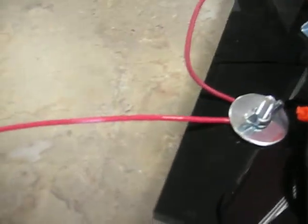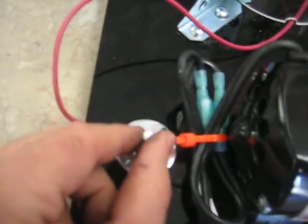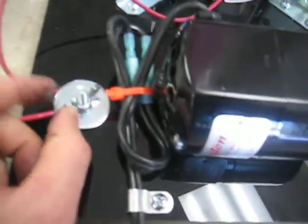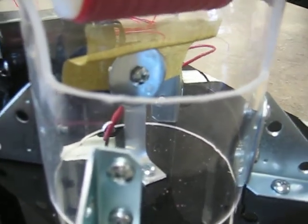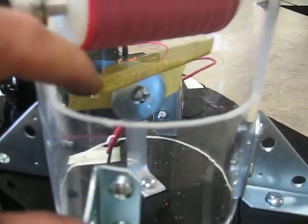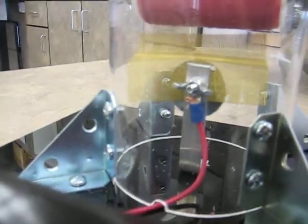The part of the wire that pulls electrons from the ground — you can see the very end of it is connected to a little alligator clip, and then it's connected using a larger quarter-inch bolt with a fairly large fender washer. The wire wraps up through here and you're going to see a little notch, and then it connects to the very bottom aluminum brace. The aluminum brace will have to be hand-bent, which you can do with needle-nose pliers. On the other side there's another fender washer that holds the brass comb onto the brace, and on the other side we have a wing nut and a little blue wire connector to hold it in place.